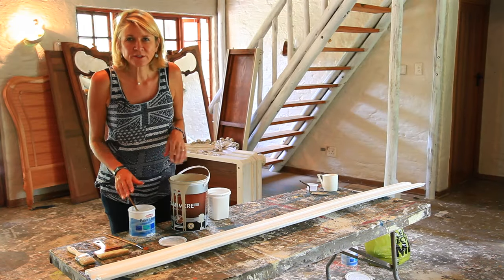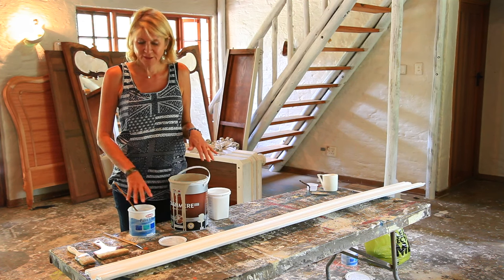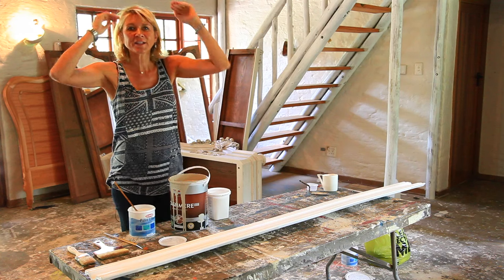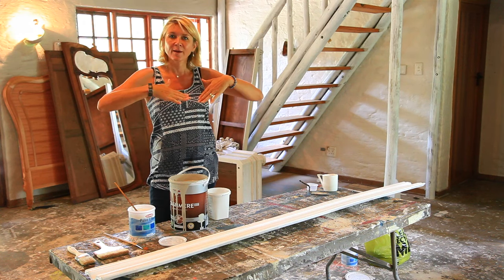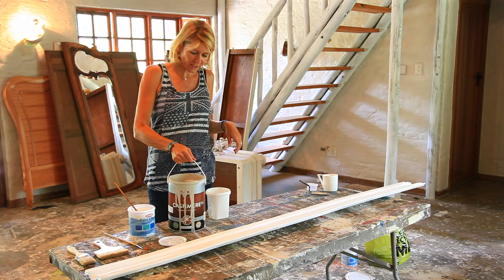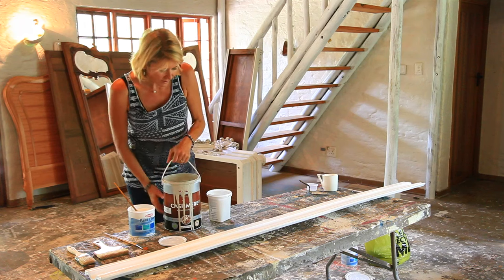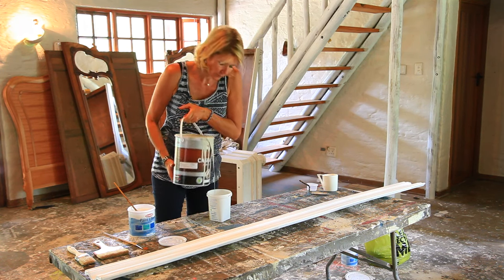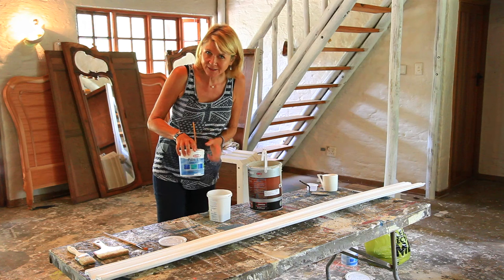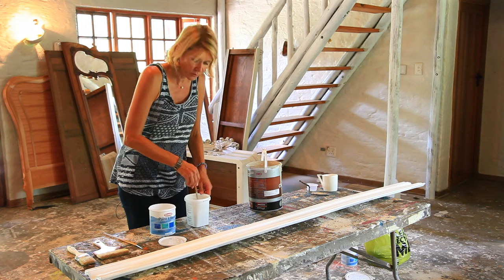If you would like to take the corners a little bit further, I'm going to shade it using the paint wall colour and scumble glaze, and this will have the effect of taking the colour from the wall up, rather than taking the white of the ceiling down onto the wall, thereby actually lifting and giving you more height in your room. The colour is called Safari Tan — it's the colour we used on the walls in the room. I'm going to mix it one part Safari Tan with one part acrylic scumble glaze, that's GSL2 by Plascon, and one part water.